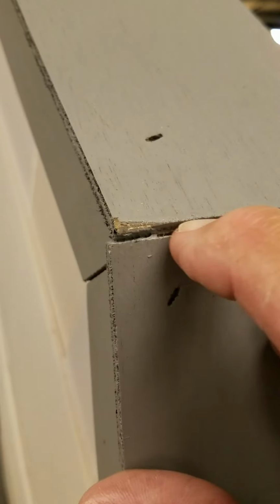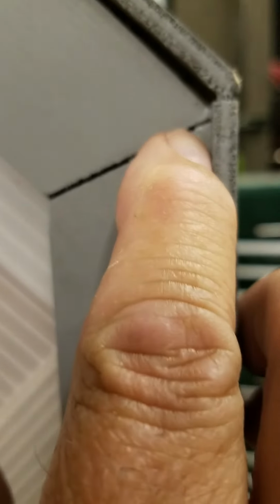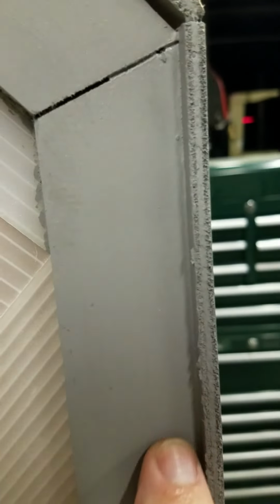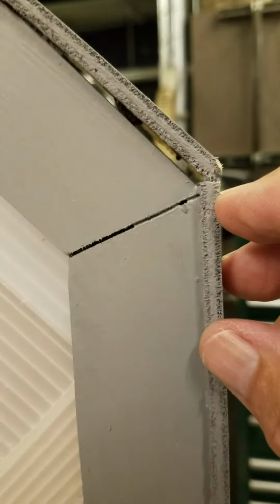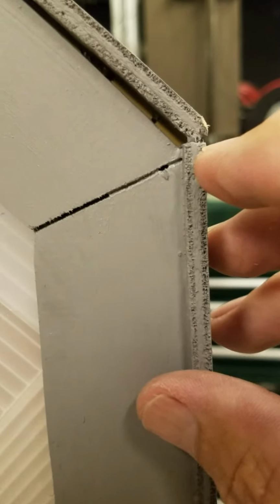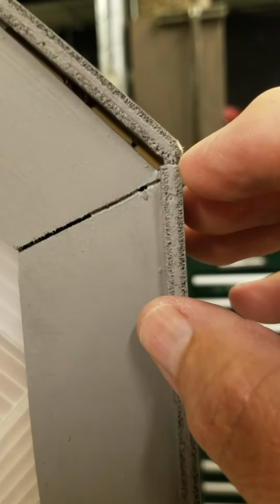And what I recommend on this, in order to get a clean edge, meaning when these two come together, what I do is measure, again, this being exactly, if we're creating a 6-foot unit, then this would be 4 foot long. So then I would cut this right at 4 foot. So you can see this is our first prototype, the things we ran into. Sometimes we do our best in trying to make this perfect, but sometimes it doesn't work.